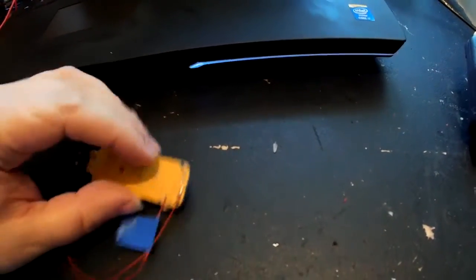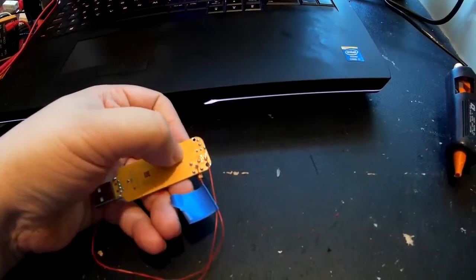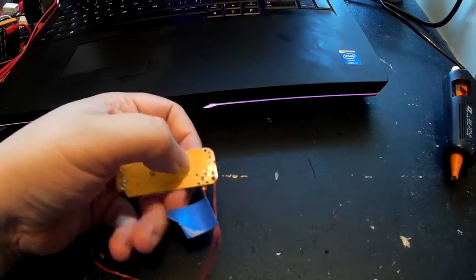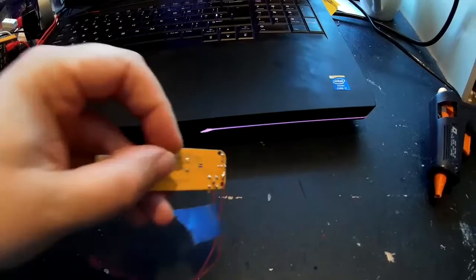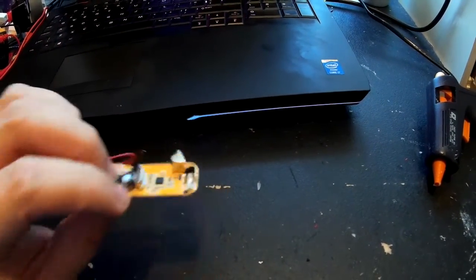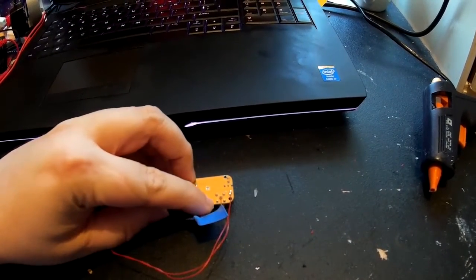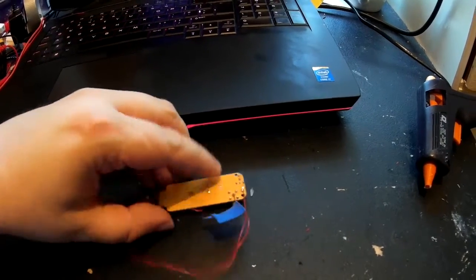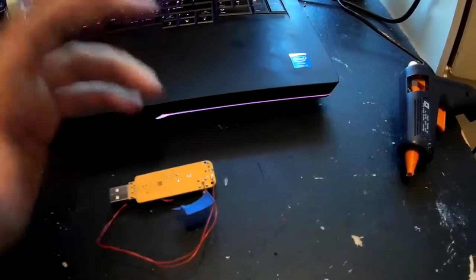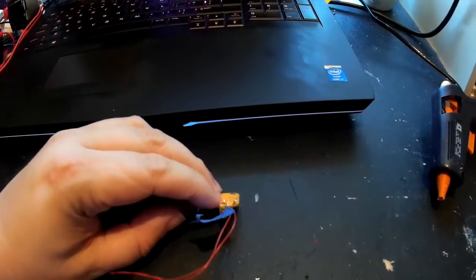So what I did was I just scratched off some solder resist or solder mask from an area of the ground. I don't know if you can tell or see in this camera. So this whole sort of, we can see all the micro vias, the via stitching or whatever it is, the vias, all patching into ground along here, up here, and that's all ground. So yeah, scratch off a bit of thing, reveal some copper, solder to it, you got a ground connection, no problem. And then I just had to persevere with that middle connector.